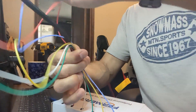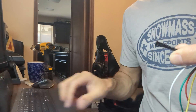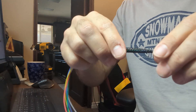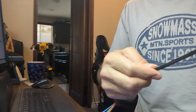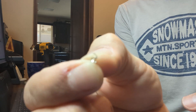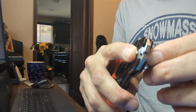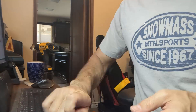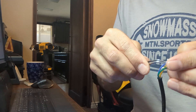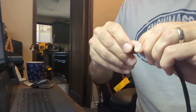Then it was time to finish cabling everything. I built all my wires from scratch — here's a quick process: cut the wires to length, cut a braided cable sleeve to length, melt the end so it doesn't fray, then push the wire through by scrunching the braid up and pushing it through. Then strip the ends of the wires to be ready for the JST connectors. These are 2.54 mm — the large connectors. Stick them into the crimper, insert the wire, get it lined up to exactly the right depth, crimp it down, and you've got a wire. Rinse and repeat five more times, then gently push the wires into the connector, using tweezers since the silicone wires are a little delicate.